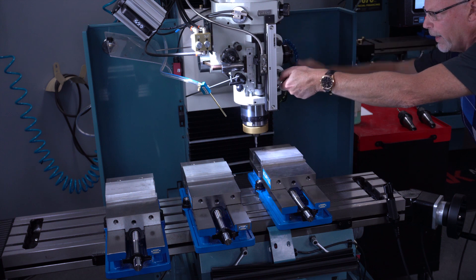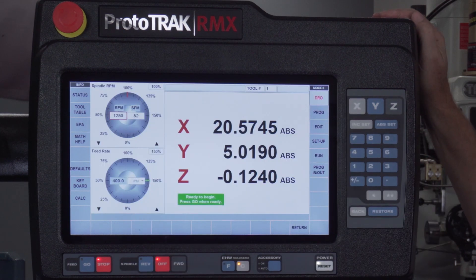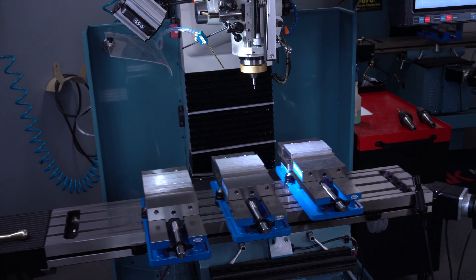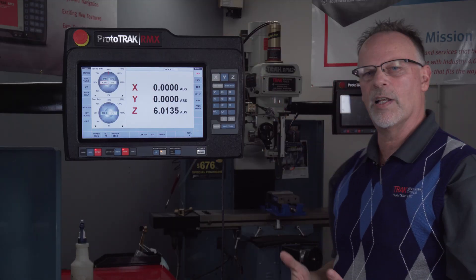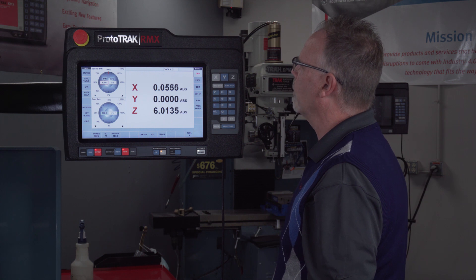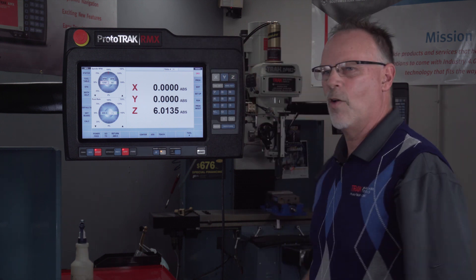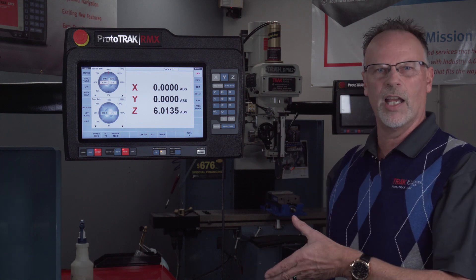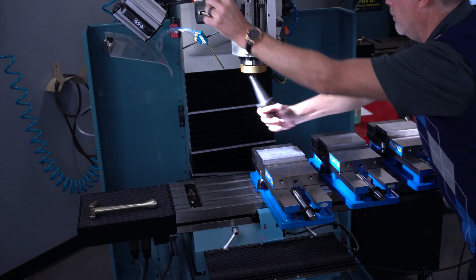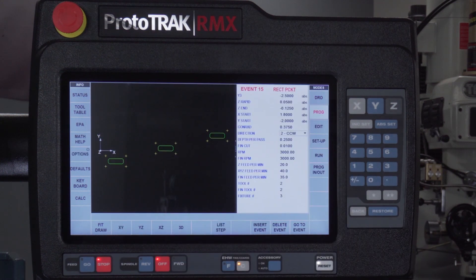Now I'm going to put the quill back up and send it home to zero. I'll hit return, go back to DRO mode, say return to absolute zero, and push go. Now that I've got all this set, the only thing that's wrong is that each of my fixtures is off by a hundred thousandths in both X and Y, because I didn't compensate for the edge finder radius. So I'm going to simply move it over a hundred thousandths — that's X zero, then Y zero.